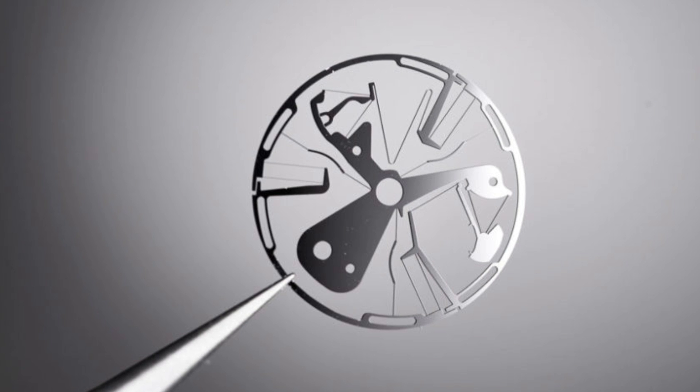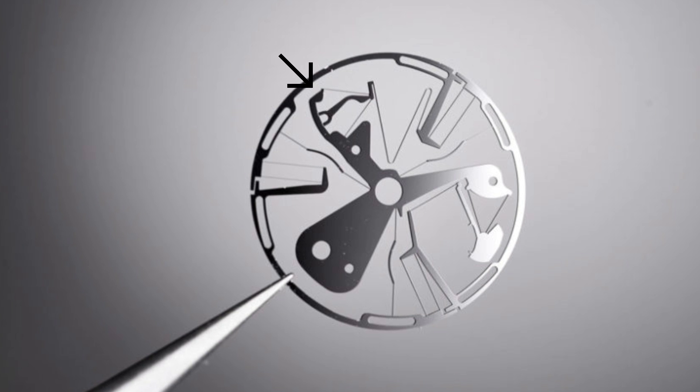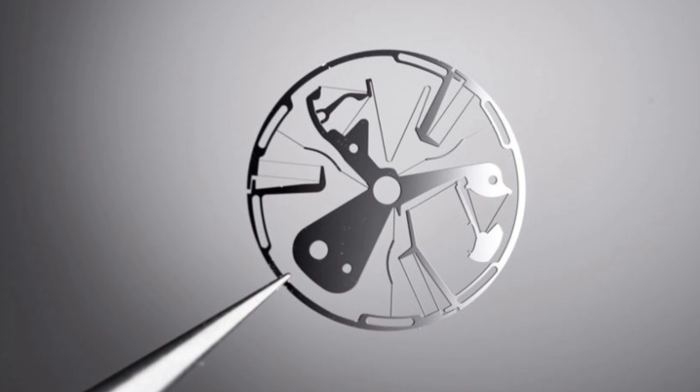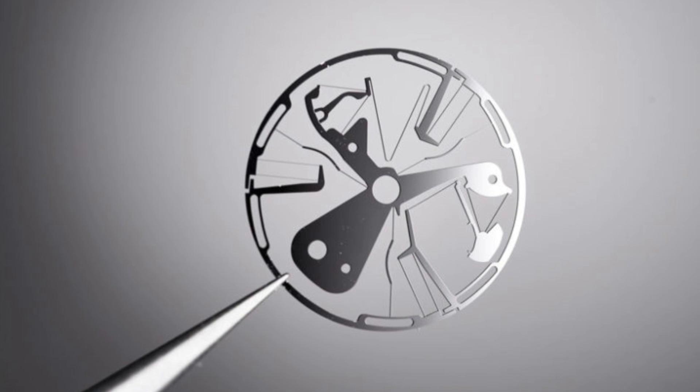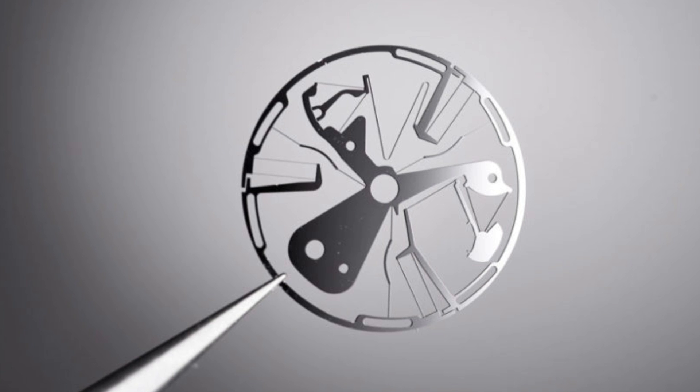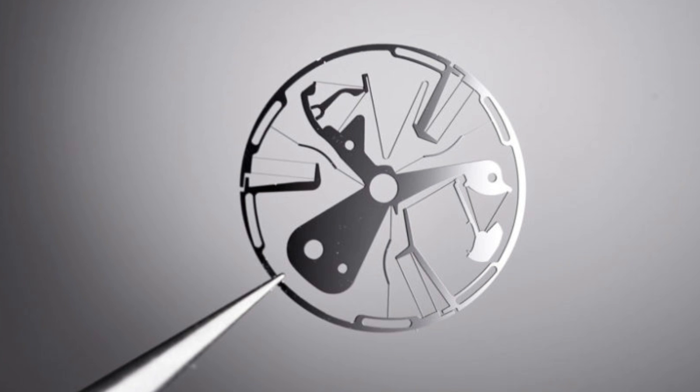This is also the case with the regulation of this watch, which is again built into this piece, with a small tuning fork-shaped arm placed at about the 11 o'clock position being able to be moved to adjust the timekeeping by up to 300 seconds a day. This gives a fair deal of adjustment to this watch, where many watches simply don't have that sort of adjustment out of the box and require re-weighting of the balance wheel. I apologise for going on with the details of this movement, which I find absolutely fascinating, but I felt it was important to discuss these before talking about the working specifications.